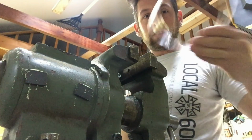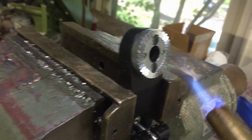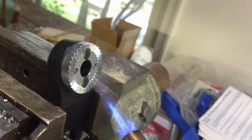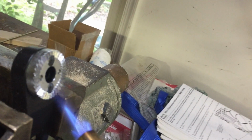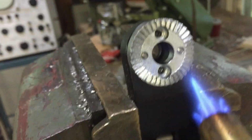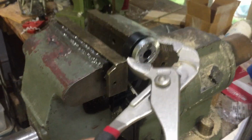All right, we got safety glasses, a pretty big vise. We got our part, lighter. We got our blowtorch. We gotta heat up this part, break the adhesive that's holding it to the part beneath it. A little bit of a hammer. Ooh, it's wiggling. Boom!